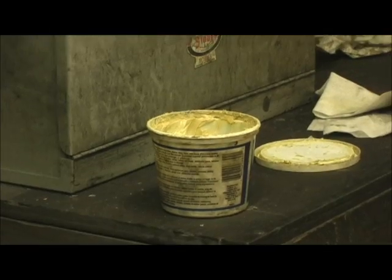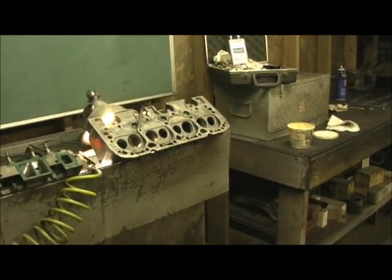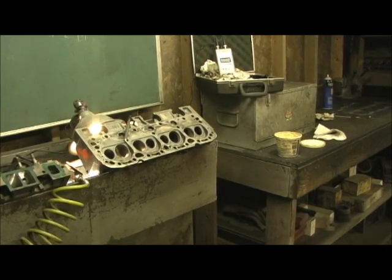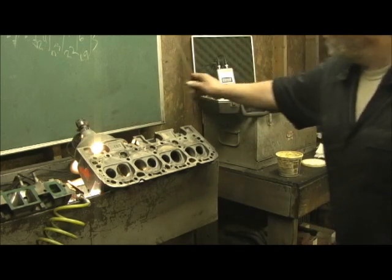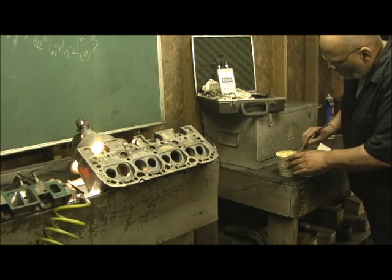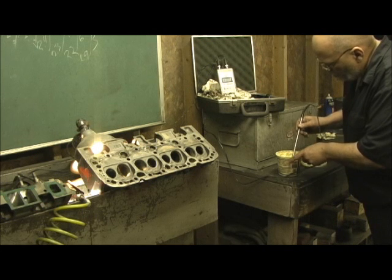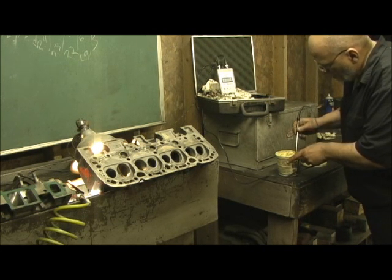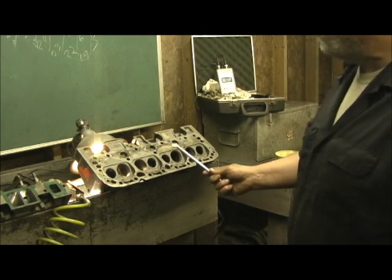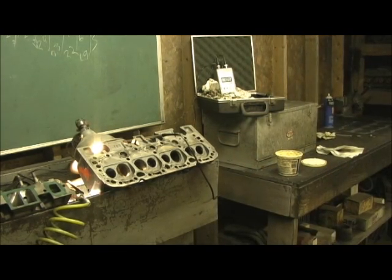What you see right here is white lithium grease — I keep it right beside the head, along with my sonic checker. You take your sonic wand and go in here and dip it in a clean area of the lithium. The reason you do this is it acts like a contact patch, and if you don't have the lithium on there, this turkey just will not work. You've got to make sure you've got a decent little chunk right on the little green piece. Then you come over here and put it inside the bowl to make different measurements.